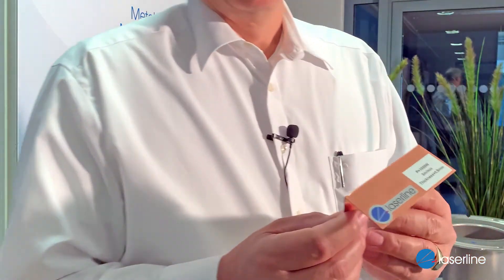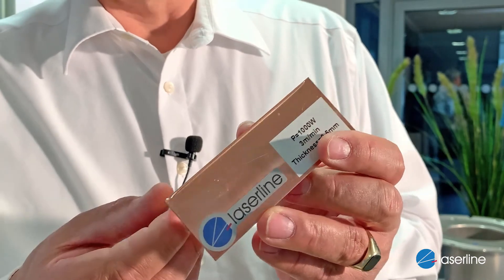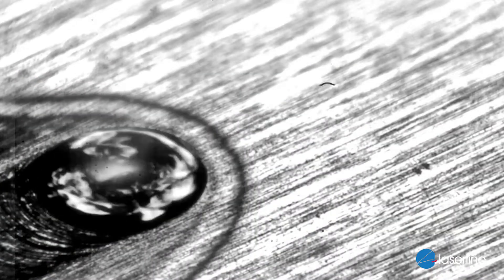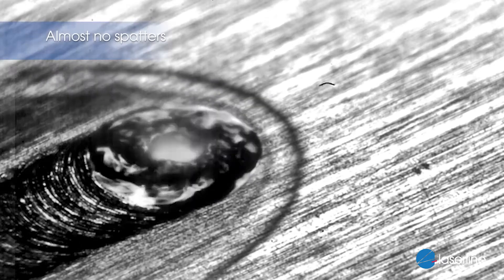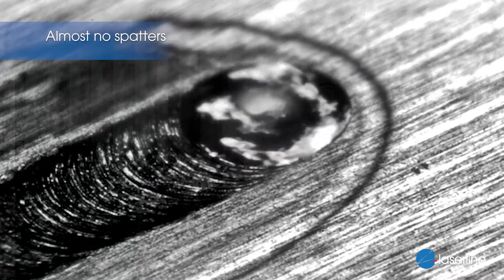Here is an example of copper welding, and we use our blue laser to do this. Unfortunately I cannot show all of the samples we did for our customers — many are NDA protected and we take this very seriously. Here is just a simple example of copper welding, and in this sample you can see it's a very good surface. The blue laser for copper creates a spatter-free application — no spatters at all. Especially in electromobility where current is going through the parts, we don't want spatters because they can cause short circuits and issues.